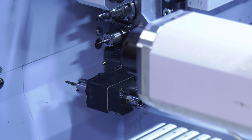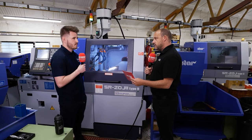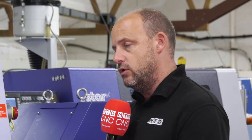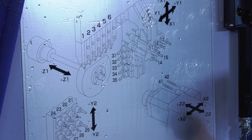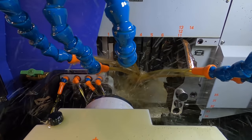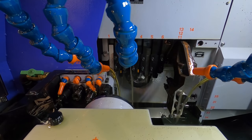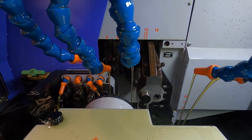You've also got a Y-axis on the J2 compared to the J. How does that impact you and what does it allow you to do that you couldn't do before? The Y-axis gives us a lot more movement on the back, so we're able to mill different shapes — hexagons, for example, and polar mill. Does it mean that operations you previously did on the front spindle you can now do on the back as well? Does it help you balance out a part?